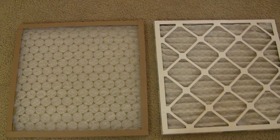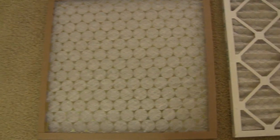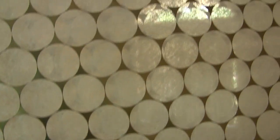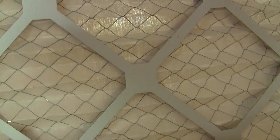Hello, my viewers. In this video I want to compare the quality of both the fiber type of air filter, which is this right here. If you can see, you can actually see right through the filter — see how you can see the light right through it? So you're going to have some particles definitely going through it, whereas the pleated type of air filter, you might see some light going through it, but not like you do on the fiber type.